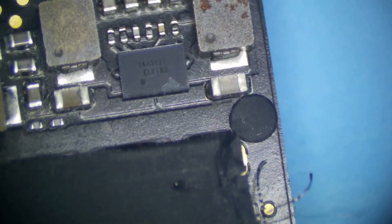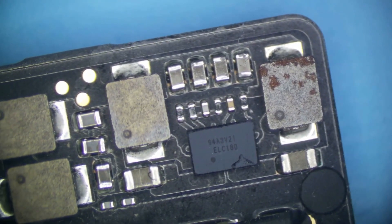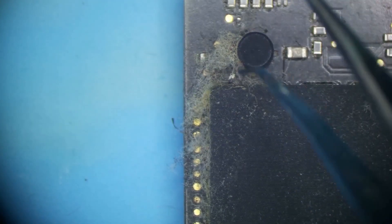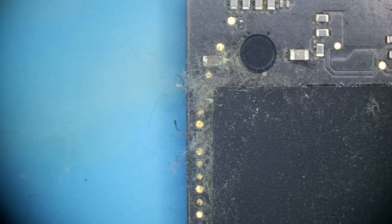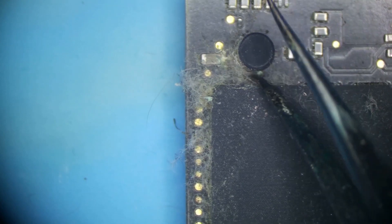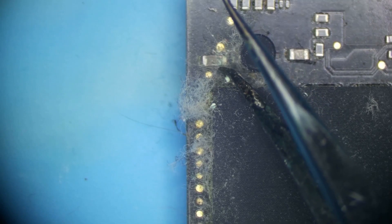You can normally see when a ceramic capacitor is shorted. This might have an issue, I'm not sure. These capacitors do look like they've been a little oxidized before, and there's some rust on that coil. Now, if you see here, there's a lot of dust here. Dust and hair really affect what happens — if you live in a humid environment, the water is going to condense right here, and when moisture condenses there, you get issues like this. So here's a capacitor that is most likely the cause of our short.